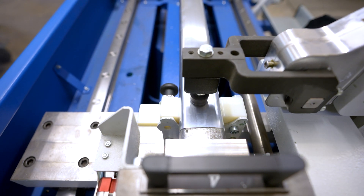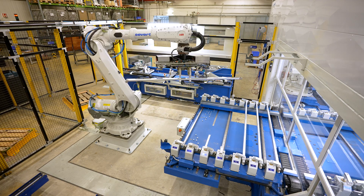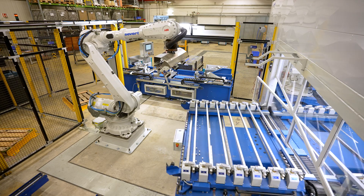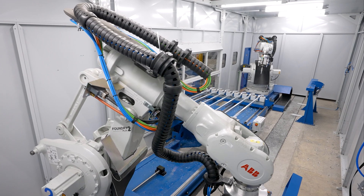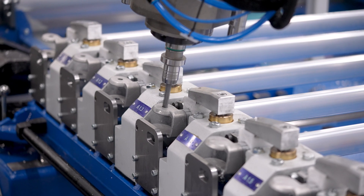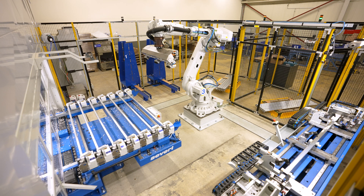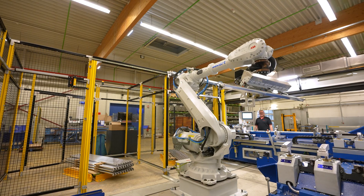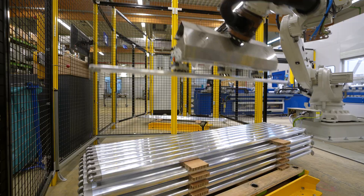This is where the handling robot comes into play. It takes the arms out of the press and places the assemblies on the swivel table seven times in succession. The table then rotates into the machining room so that the two machining robots can drill, countersink and deburr the forged components in parallel until they are finished. The table then swivels back into the handling area where the handling robot takes each item and places the upper or lower arm onto the appropriate pallet, putting packing between the components to prevent damage during transportation.